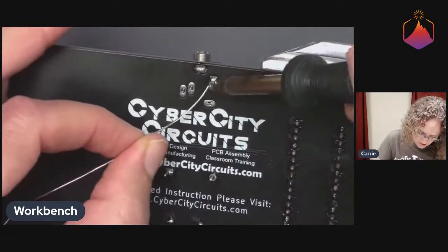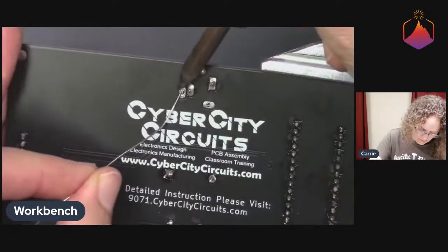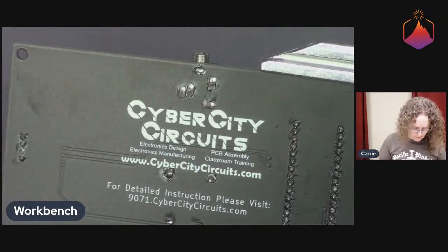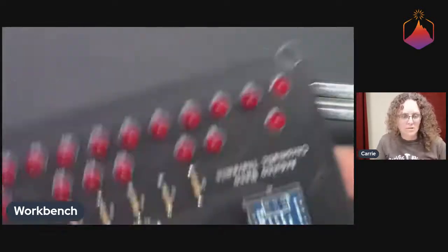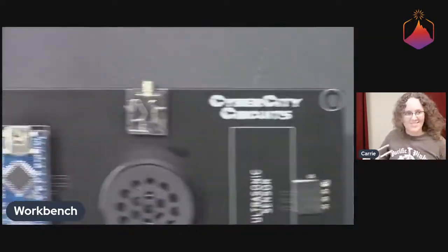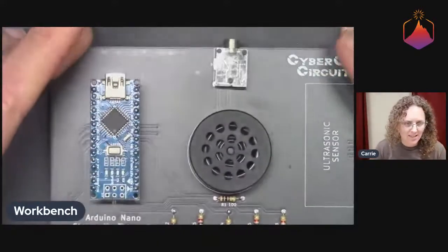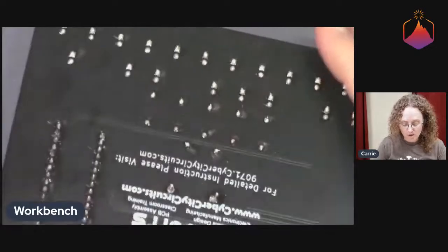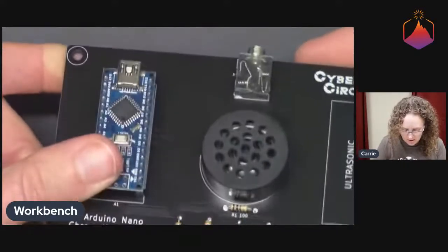Solder in the last one, right? I think this is the last component. Cool. Awesome. Yeah, Bob says the 3.5 millimeter jack is a little difficult to coax into place. Make sure all the pins are through. Yeah, I think there was a little bit from the hot air soldering level finish on the board. One pin had a little bit of solder in the hole, and that's why it was giving me some trouble.